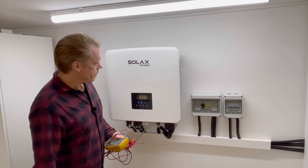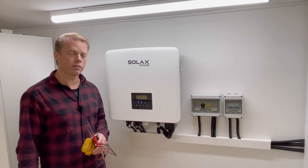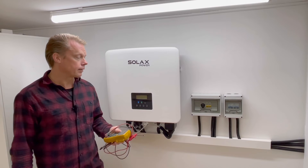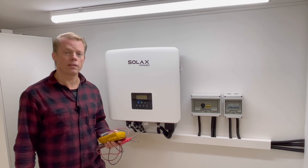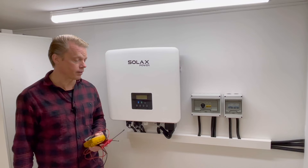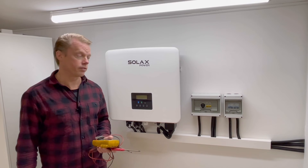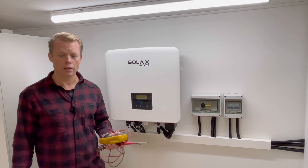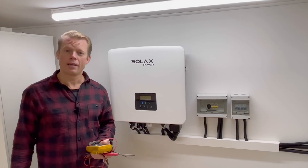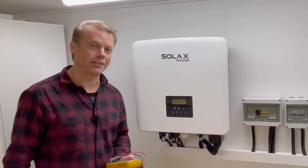That will be everything for this video. The resistance measured was 76.2 kilo-ohms. If you have that kind of resistor laying around, you can probably just hook it up to those pins and try if the inverter starts up and takes power from your battery. After that, of course, order a real NTC resistor that will properly work with this unit. I hope you find this video helpful — as always, have a fantastic day. Don't forget to subscribe and give me a thumbs up. See you later, bye bye!